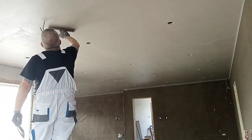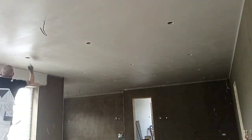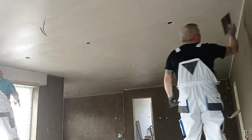On our second trowel, we'll stripe from wall to wall, troweling into the direction of the light which is coming through the window in the room. Normally at this stage we are having to use water to trowel up.